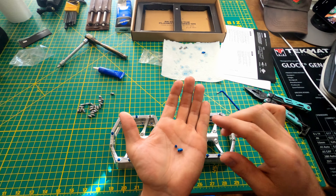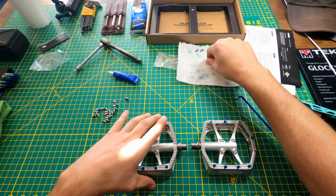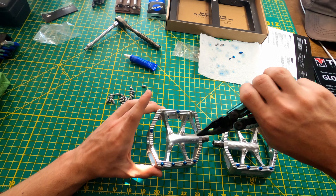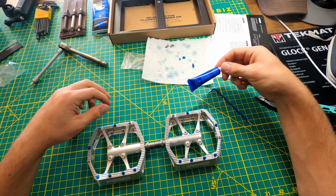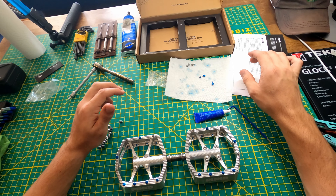I did break one of them, and most of these go all the way through. So you can go in with some pliers if you twist it too much and just keep twisting it through. These pins only need about 2Nm and some thread locker to stay in. They're aluminum so they're a little bit fragile.